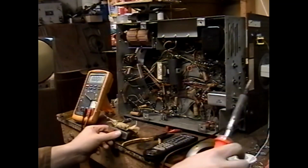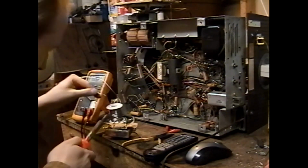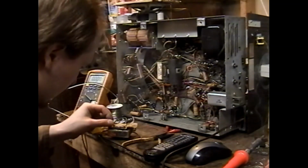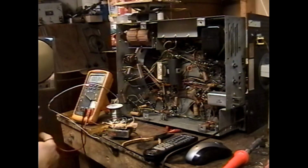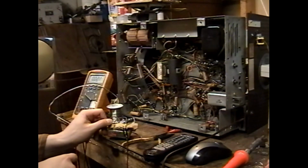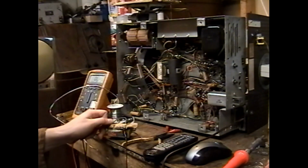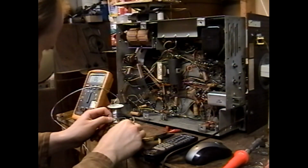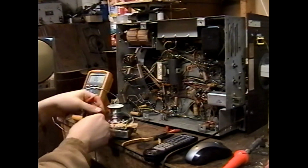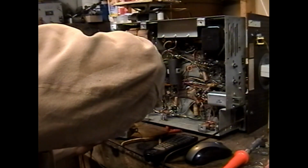And then Tom goes and reinstalls the original vertical output transformer when he ends up fixing it. Yeah, that probably might happen. I think I've tinned that wire enough that I can get a continuity check on it. Let's clip onto the blue and then... Oh, yeah, it helps if you're in ohms mode when measuring continuity. I'm still not getting any. Meter leads are good. What if I twisted this onto the red a little bit and then soldered it?